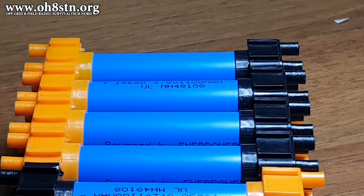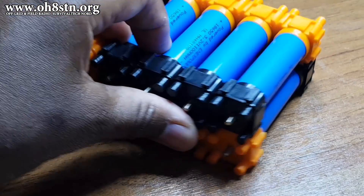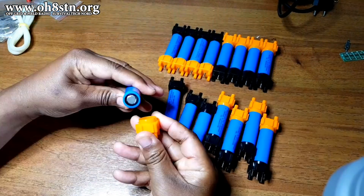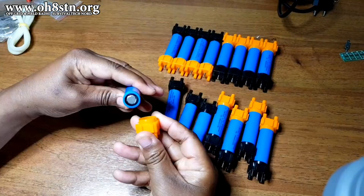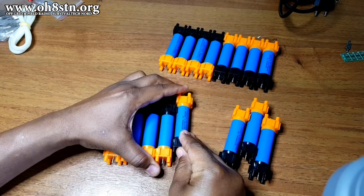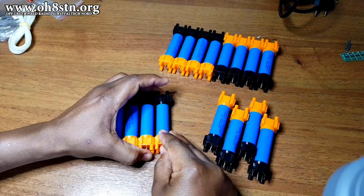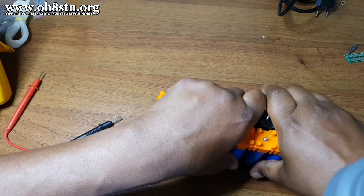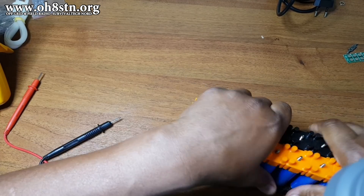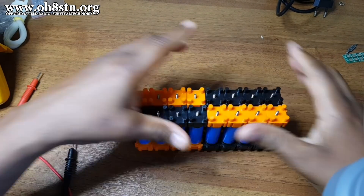Micah has some amazing videos on putting these end caps and packs together — I'll put links in the description. The technique I'm using is one by one, side to side. As I'm doing a two-layer pack, one layer is always exactly reverse of the other in terms of the end caps. The only way these layers will go together is if each end cap has been installed correctly — if they have, the layers will slot together extremely easily. This is what our pack looks like with the end caps on and the layers combined, with the bus bars not yet installed.